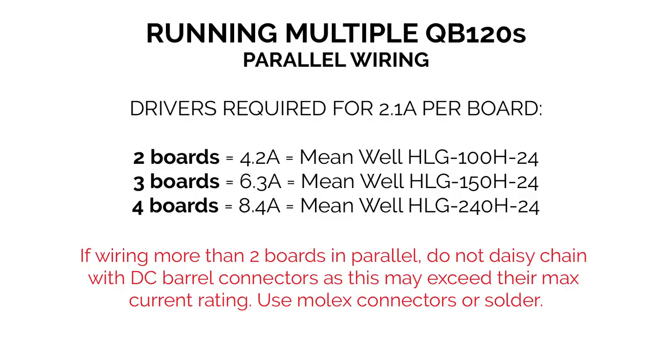If you run one of those 24-volt constant voltage drivers, there's one important thing to avoid: running full 24 volts through your circuit. At 24 volts these boards may pull something like 3 amps, which is too much. The sweet spot is about 23 volts. On an A-type driver you can turn the voltage down right on the driver with a small screwdriver; on a B-type, you can dim it down indirectly using the potentiometer to restrict current until it hits that voltage. So whatever you do, aim for 23 volts, not 24.